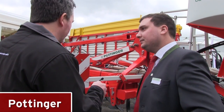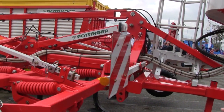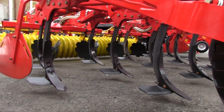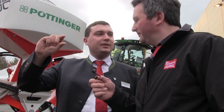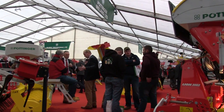Now here with this machine — it looks about four meters wide, and this is the four-meter version. It's specialized for seeding. We want to focus on working quality — very shallow working as well as deep working. It's very important to go through the stubbles very shallow so that all the wheat can grow again very quickly. You're germinating the weeds with the first pass. We can go four or five centimeters and make it even, so every crop can grow very well after harvesting. The maximum working depth is up to 15 to 18 centimeters, no problem.